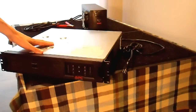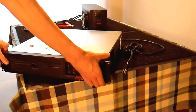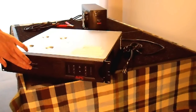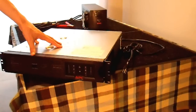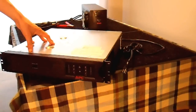This is a 2U height rack mount unit. I looked up the specs on it — it actually weighs 65 pounds, so it's a pretty beefy thing. There are batteries in here that make up a good portion of that weight. But despite its name — 1500 — it is not a 1500 watt unit, nor is it a 1500 volt-amp unit like you'd expect. This is actually a 1440 volt-amp unit, or 980 watts. I'm pretty confident that by the time we're done with this it'll be quite a bit better than 980 watts.